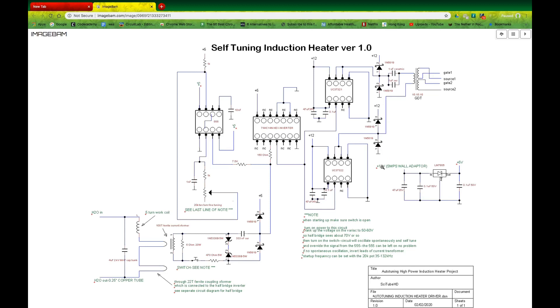Things have to be phased correctly because you're taking a positive signal here and generating a negative signal here, which really doesn't matter because you've got inverting or non-inverting gate driver chips. You just have to make sure that your current transformer is in the correct direction. And if it doesn't resonate, you need to swap the leads on it.